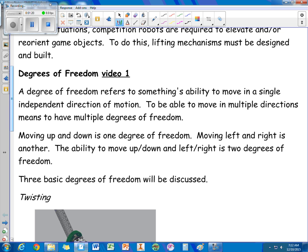When we look at a coordinate system we have three axes: a y-axis, an x-axis, and a z-axis. The ability to move along any one of those three axes is a degree of freedom, giving three degrees of freedom. Rotating around each of those axes adds three more, for a total of six degrees of freedom.